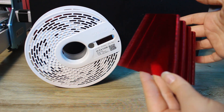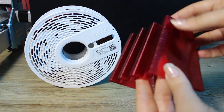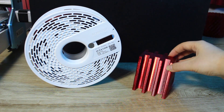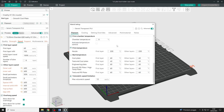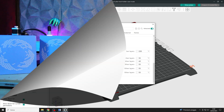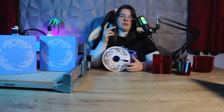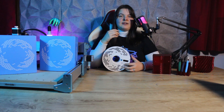There are some imperfections on the curves because I haven't calibrated the profile for that speed, but as you can see the straight segments are perfect. If you are looking for a transparent filament to print with a high-speed machine, this is the perfect material for you. It will also allow you to use larger nozzles for that thick layer effect — highlighting the layers rather than trying to hide them. I haven't talked about 0.8 millimeter or larger nozzles on the channel but let me know if you might be interested.